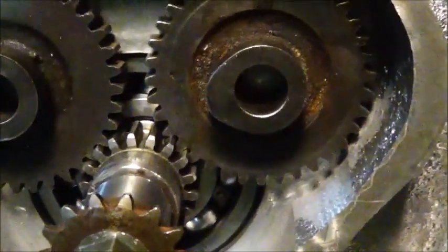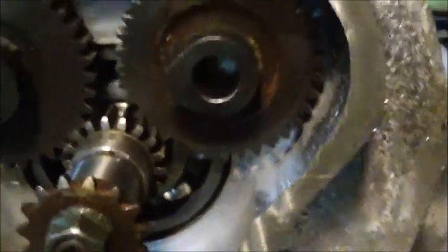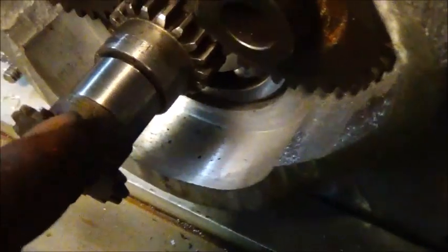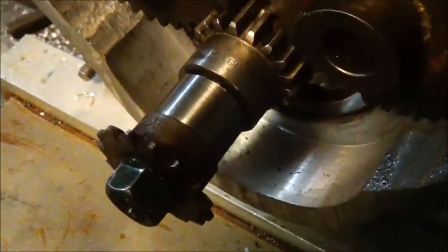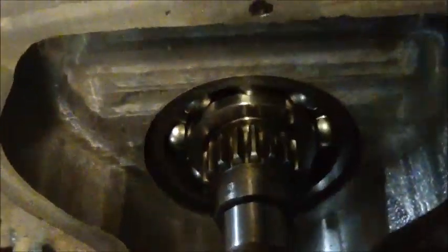I'm going to get another cam on the way. I'm kind of glad I went with the small chain - I think it'll work out better and look a little better. We've still got to key the crank - I'm going to key both sides. Because I bored my holes the size I wanted them, I'll be making the insert that goes in and I'll just buy a broach. The piece that goes inside that's slotted for the broach to go through, I'll just make them, and we'll broach it on the arbor press over there. Everything's still good and free when I don't have the cams stuck in.